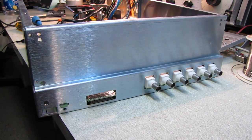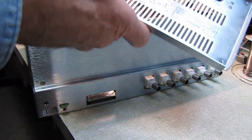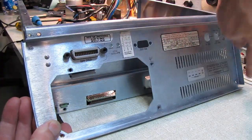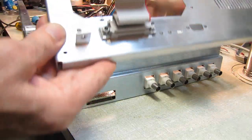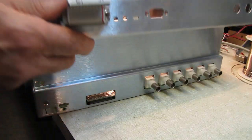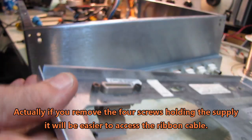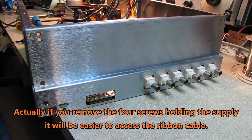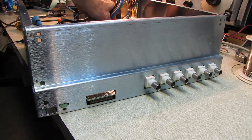There's a connector here and a connector there — it comes right off, just set that aside. The rear panel has four screws — one here, one here, one here, one here — and on the bottom there's two screws on these little brackets. Unplug this connector, take out those two screws, and the whole thing will come out with the power supply attached. Then remove the four screws mounting the power supply and you'll have the power supply in your hand. It's a piece of cake, but the reason I'm making the video is there's a gotcha.